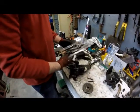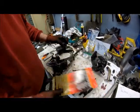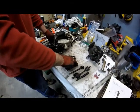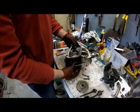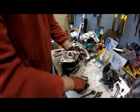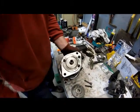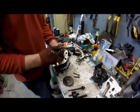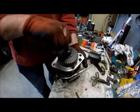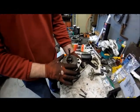How we're going to press our gear on is basically the same GM special tool that you'd use on this style pump that had the pulley. This is the hub puller, which is a power steering pump pulley kit. This will pull off the gas engine pulley. Then this one here is going to help reinstall the gear. So we're going to put this back on — inside the shaft is a threaded hole. We're going to screw that down in there, then put a wrench on here and screw this, and that's going to press that gear right down on the shaft.